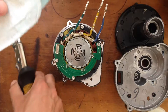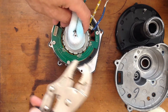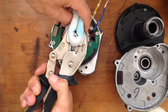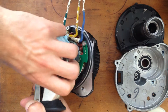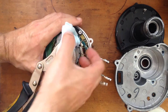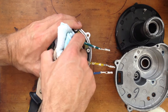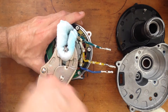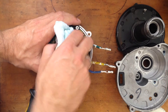Use rubber instead for protection. Put it in here and lock the ply — not too hard, don't go too hard on the gear. Leave a bit of area so you can put your fingers behind and use both hands: one holding here, another gripping the ply. Bring it and try a little spinning movement. Spin to the left-hand side, because the helical gear is to the right-hand side, so spinning left means the ply is very likely to come out.